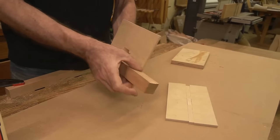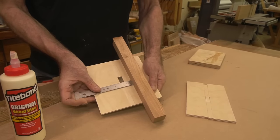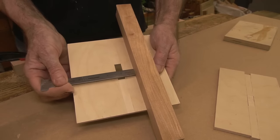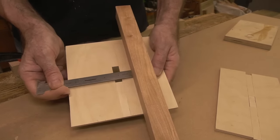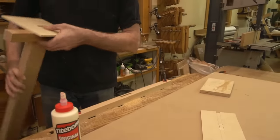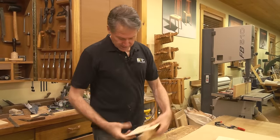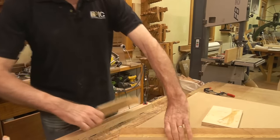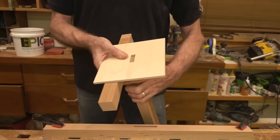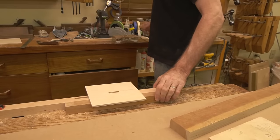Now with this one, I just tacked a straight edge on, and by coming on the underside like this I could measure exactly to this wall. So if I wanted my mortise to be seven-eighths from this fence, I would put it at three-quarters plus a sixteenth — then I'll gain another sixteenth from the collar offset, which puts me at seven-eighths. This template works great in any form — I don't even need a straight edge along an edge. I could tack it to a surface at whatever angle I wanted very quickly, then bring my router up.